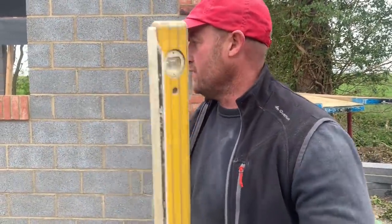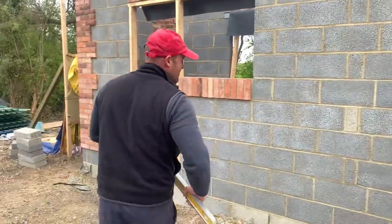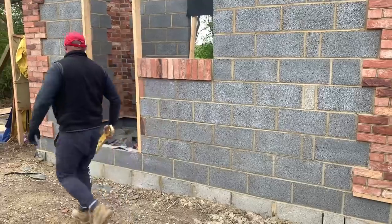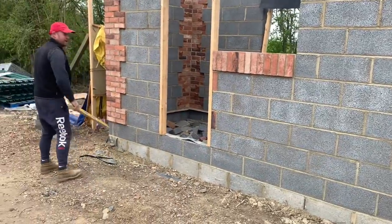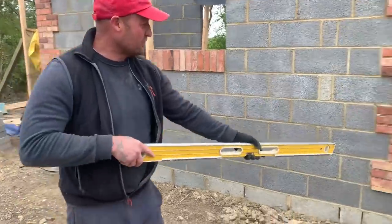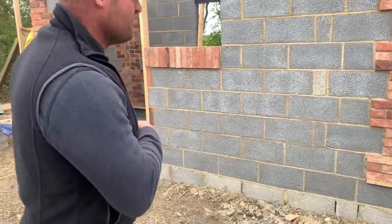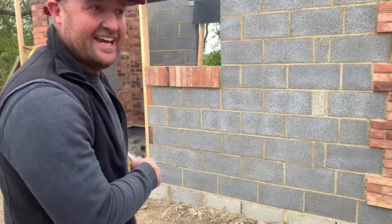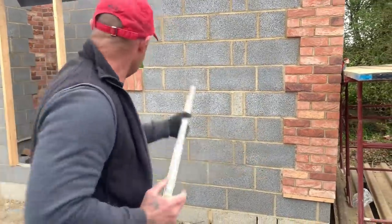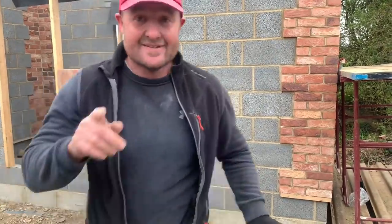A next valid point is you can see, always mirror what you do. Can you see I've got two stretches there? Always go two stretches the other side. I've actually seen before, believe it or not, where they've gone two and one and a half, reversed it on the flank. It looks awful, okay? So the correct way is, whatever you start here, mirror it down there, okay?